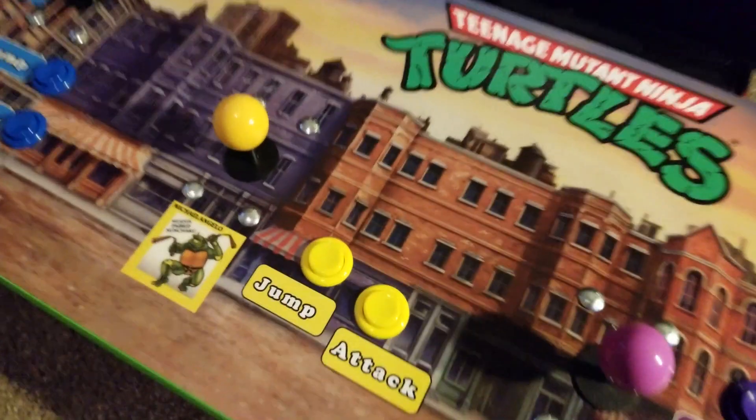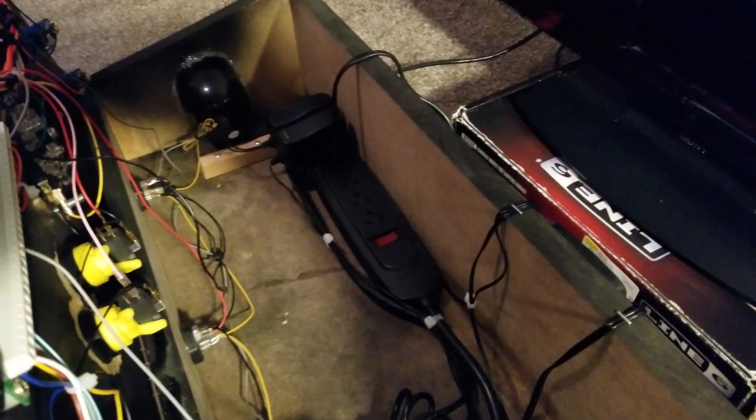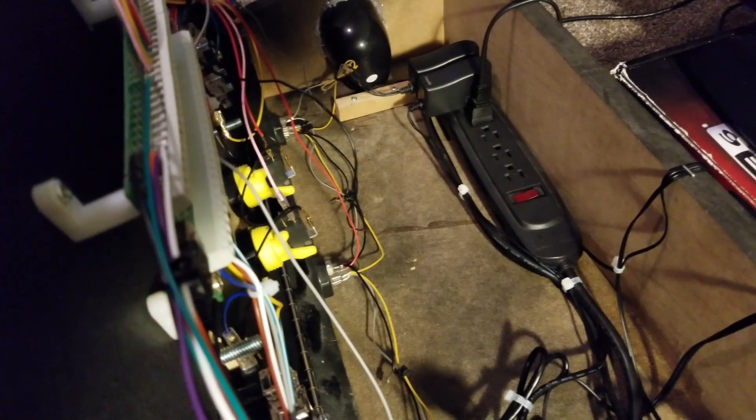For those who work with Raspberry Pis or have created consoles with them, it's pretty straightforward. The Pi is right there, panel mount power right there. I actually cut the wires to a power strip and mounted one on the inside so everything can be plugged in. All the buttons are connected to an iPac4 — awesome device. I have a JAMMA arcade cabinet and it works really well, so I went with Ultimarc again for that. I have cheap computer speakers mounted left to right with speaker grilles on the side, and there are also the coin buttons at the front.